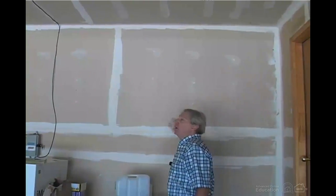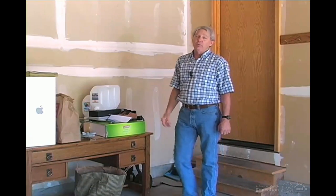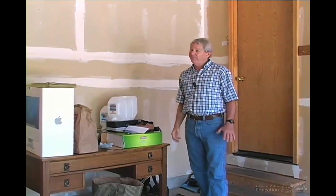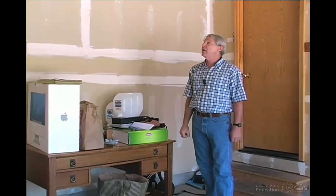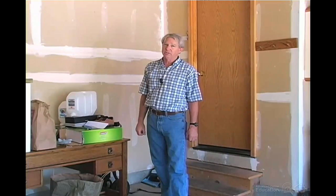One common area for roof framing defects is where the garage roof framing meets the 2-story house, especially in roofs with trusses. In roofs with trusses, the support for the garage trusses is often right at the wall of the house. And personally, I find a lot of defects there. Usually, the trusses are supported by some kind of hardware. You may see trusses that rest on ledgers that are actually nailed to the wall. And unless it's a fairly old house, engineers are going to call out for a ledger being bolted to the wall or being screwed to the wall using lag screws. So you want to look pretty carefully at any kind of ledger supporting trusses.